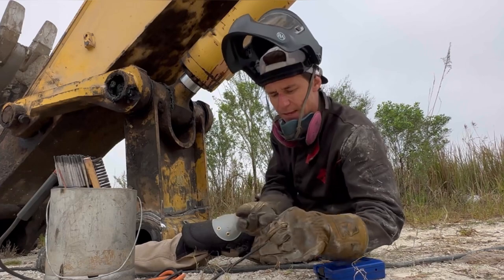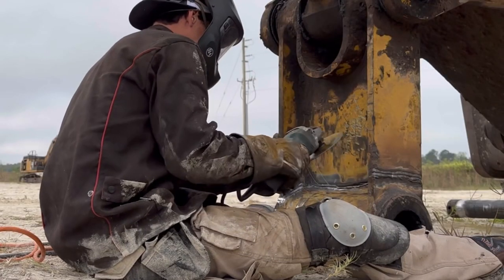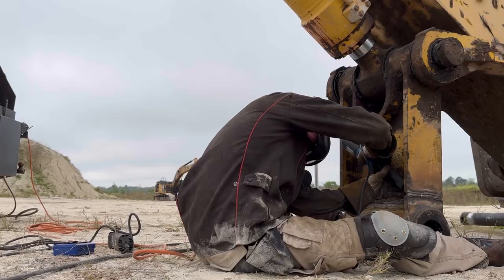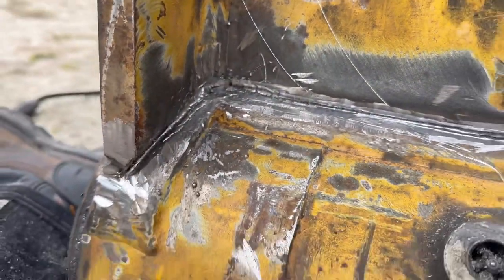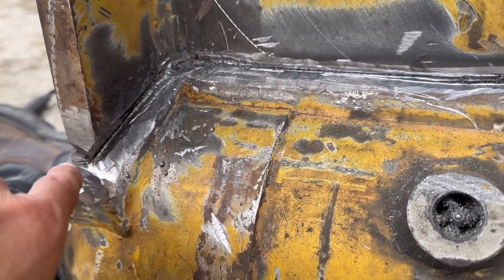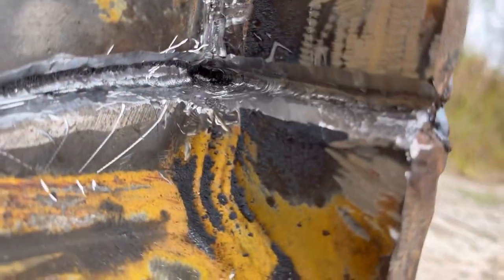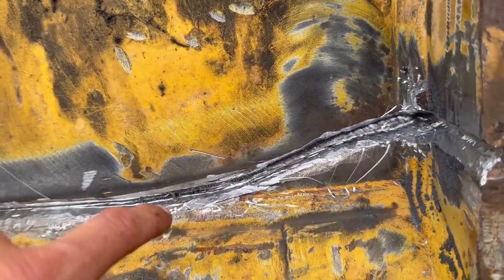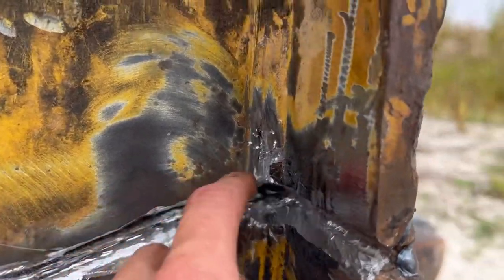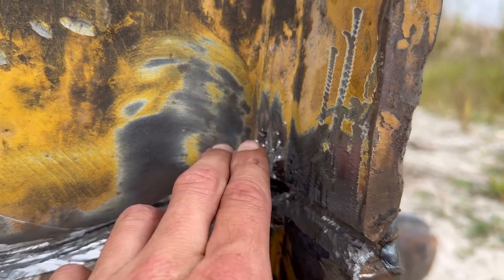I really like these carbide bits — these are actually from Benchmark Abrasive. We've got it pretty well gouged out; it looks pretty good. We've got it almost all the way into the back of that weld. I can get the rest of that with some 6010, but I can't really get the burr bit any deeper. You can see that one is into the back of that weld. That's why I ran the cutoff disc — not a big deal. But I found a crack right here, so I'm going to address that too and finish grinding that out.